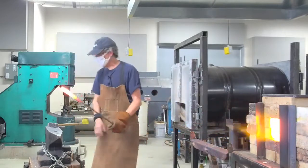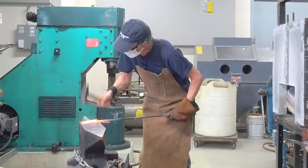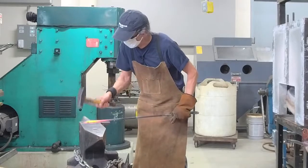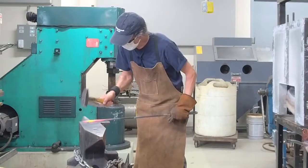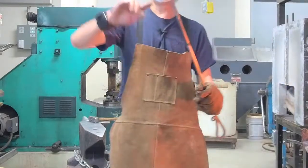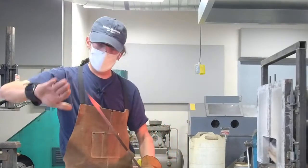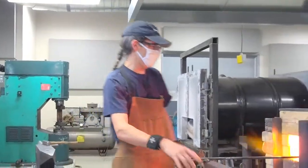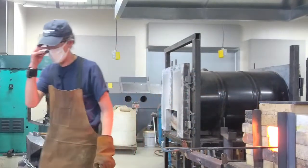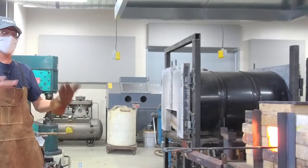The point or taper has a few rough marks. Now I want to take this tip — this barb — and open it up. It's hard to do with a hammer, so I'm going to heat it up and put it in the leg vise and use a tool that looks like a little axe or hatchet called a hot cut. I'm not actually going to cut the steel — I'm going to use it to pry it open, and then shape the tips of the tool.